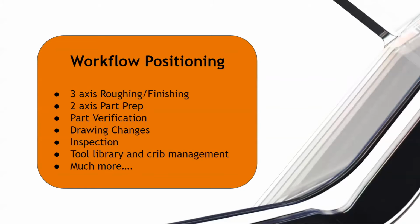And we were in a situation where it was difficult to get these parts out of the machine and then put them back in to realign them, right? So a quick little inspection toolpath that uses the probe inside my machine at the end of all my machining to go around and probe a couple of features. For example, a boss feature that's very important to the functionality of our part.